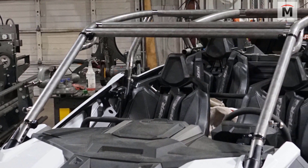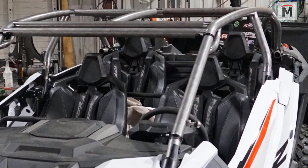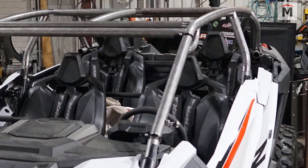Looking back, none of them were correct, but they were good enough to send something to my plasma table and cut out a part. We were building roll cages. We had a really nice CNC bender, but we would take a measure with a protractor, look at it, kind of knew what the spring back was, make a bend, and look and see how it would be.